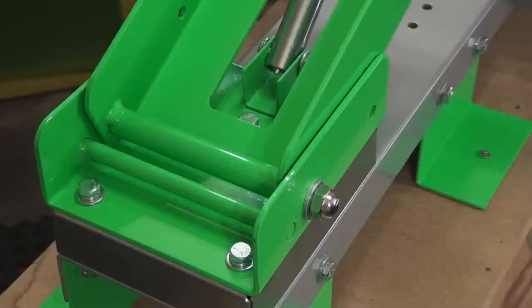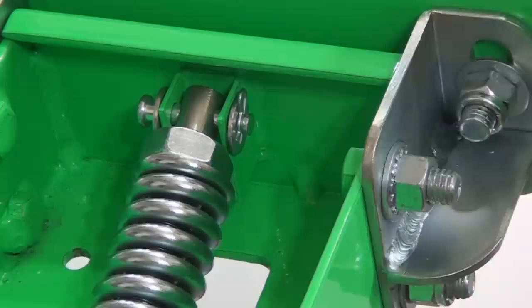Let's look at the print head and the compression spring at the back. You can see the clamp that holds the print head — it has off-contact settings and screen angle settings. There's no micro registration, but you have what we call poor man's micro reg. The compression spring is one of the things I really like about it. It's much different than an expansion spring or a gas shock and will last forever — it will outlast either of those two.